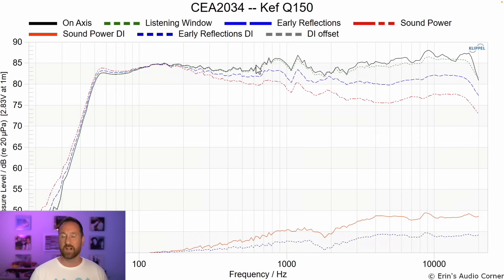The cons: above about eight kilohertz, this speaker tends to sound a bit shouty, electronic, grainy, or sharp — depending on how you want to use that term — but it's in the higher treble region. While the horizontal radiation is very consistent, it is also a bit narrow for my personal liking. Overall sensitivity is around maybe 85 dB or so — kind of in that sweet spot of 84 to 86 dB for most bookshelf speakers.